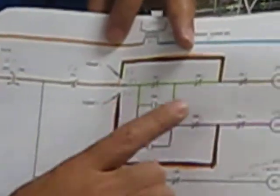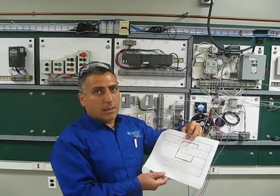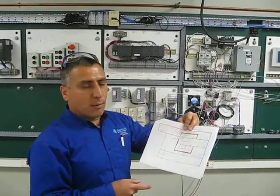Or we can go auto, which will energize pump number one or pump number two respectively — meaning number one will go on, and when pump one is done, pump two goes next. Then next time pump two will go on and vice versa, so they will alternate in picking up the load. This is basically a simulation of a lift station with two pumps for redundancy and reliability, while exercising both of them.